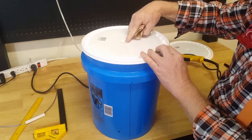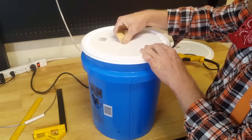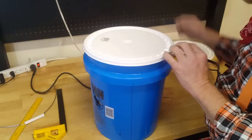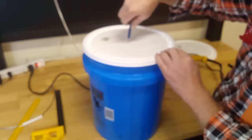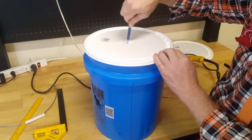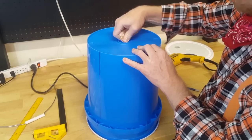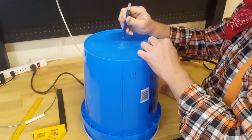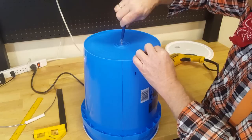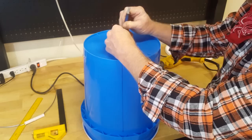Because it's got kind of a high point, it's hard to get a center drill on it. What you can do is take some coarse sandpaper — like 50 grit — and sand that down to get rid of that little nipple. Then take an exacto knife blade and put it right in the center as best you can, slowly working it to get a center hole set up for your drill. We'll do the same thing for the other side — almost all of them will have a center portion just because of molding and machining purposes when they're making the mold.